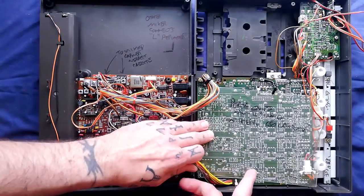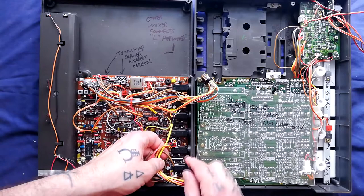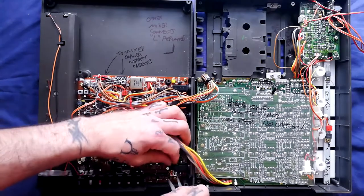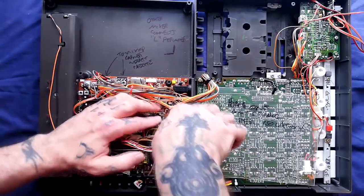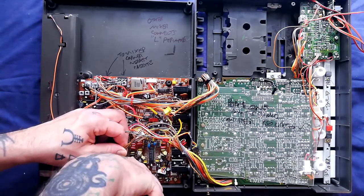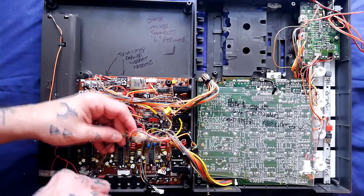Next let's look at the group of cables coming over from the side of the mixer board closest to the edge of the case. There are four thick cables here that each contain four sub-cables: brown, red, orange, and yellow — colour coding for the channels. Brown is channel one, red is channel two, orange is channel three, and yellow is channel four. They terminate in headers beside the four quarter-inch input sockets. Those cables are quite delicate, so I'm going to pull the connector away from the header using a pair of pliers. We've also got two bunches of brown and grey wires — four splitting into eight pins — going into an eight-pin header adjacent to the tape out sockets. Then over here by the DC input and the line out sockets there's a four-pin connector going into a four-pin header; they're white as well.